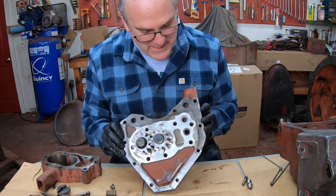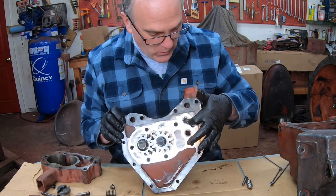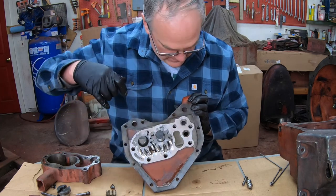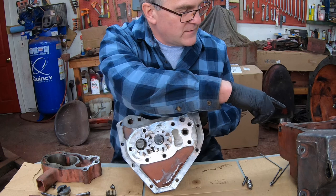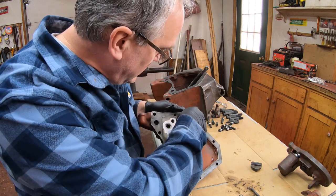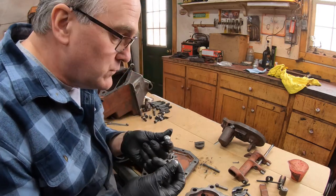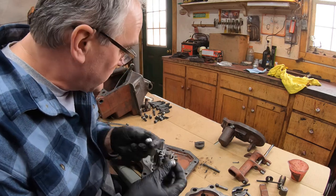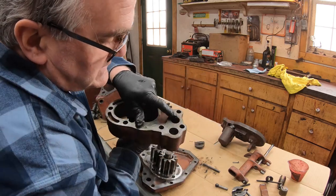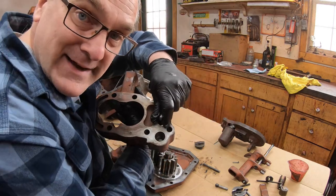In this front plate of the pump body you see these two holes — this is where the compressed oil goes out. One hole goes to this rear outlet and the other goes to these two ports here, which go into the front part of the case. There's a little retainer that goes in here, and a spring. There are two balls — these are check valve balls that sit on these springs. At the bottom of each hole there is a seat that the ball needs to sit against tightly.